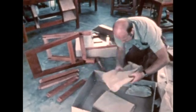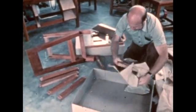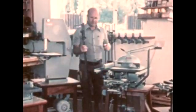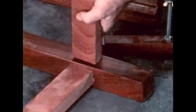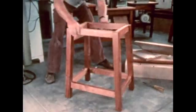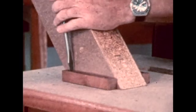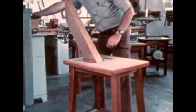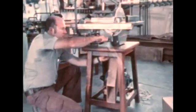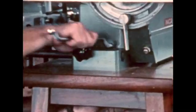This knockdown kit contains all the components of a sturdy workbench used for an INCA machine. It comes in various specifications to suit all INCA machines. All the components are pre-cut for easy assembly. Simply glue and then clamp the legs and bracing members in place, allow to dry, and then set the tabletop. Mark out the mounting bolt holes to suit whatever machine is to be used, fit it in place, and action.